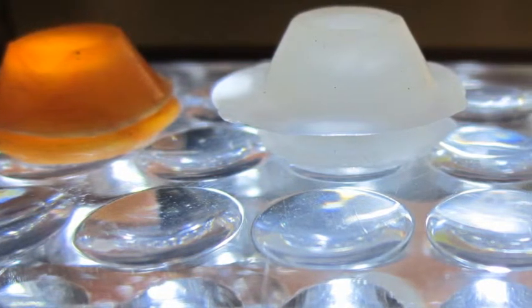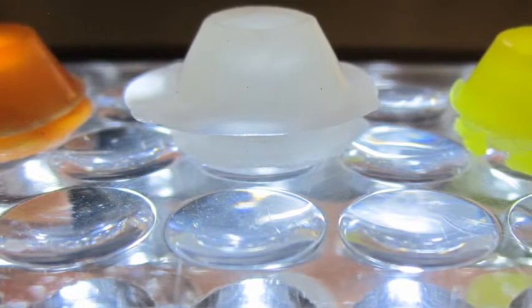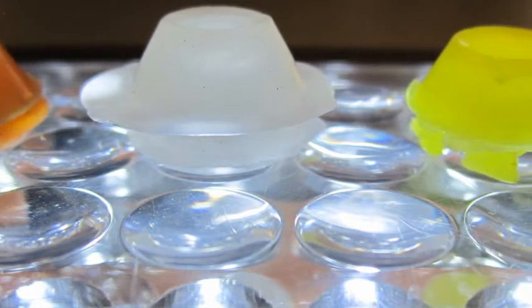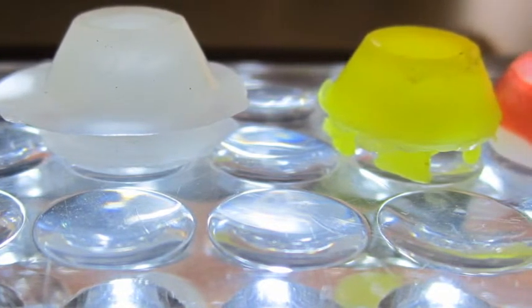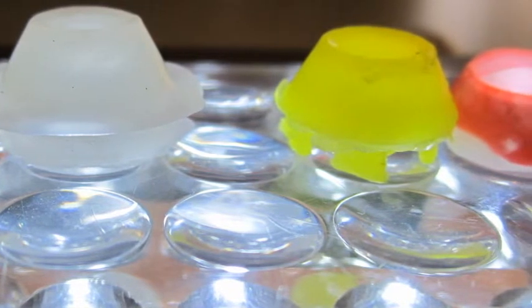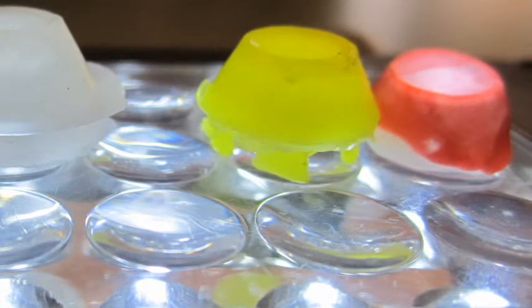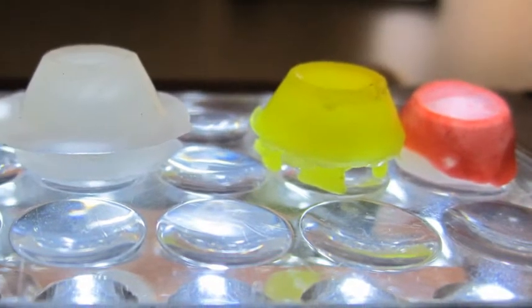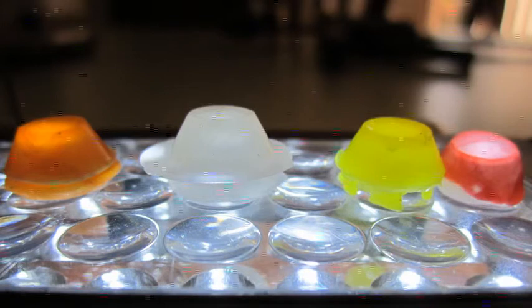After the initial testing for sizing, I swapped the split washers for a ring plate that had 2 tapped M2.5 holes in it and drilled the matching 2.5mm holes opposite the injector holes in the bottom die. This stopped completely the top flashing. For the bottom flashing, I just raised the tube a millimetre and the excess just flowed into that and just pulled off. I also placed a new bottom die assembly into the hot water after I first pushed the plastic ball in, and as it stayed hotter for longer, the plastic injected better. It was a job well done.